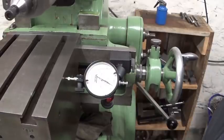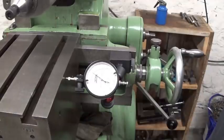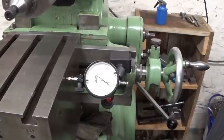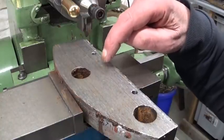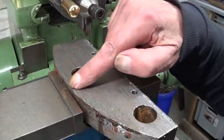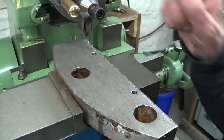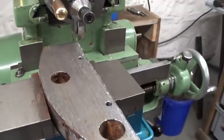Seems to work well every time, a tenth of a millimeter movement. That's what I was looking for. This is the result of a cut of a half a millimeter deep and a step over of a half millimeter. It looks like the surface has been worked with dynamite a bit. Of course, for this little machine, it was way too much. I'm gonna move a bit, maybe we can see better.